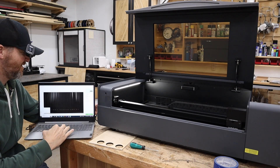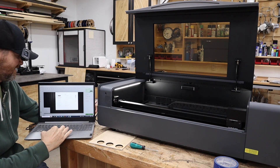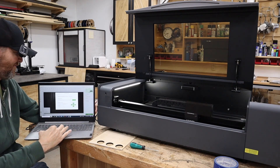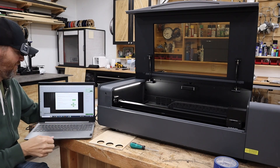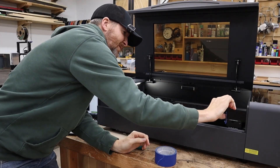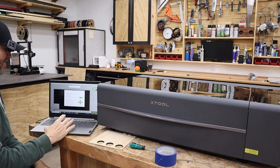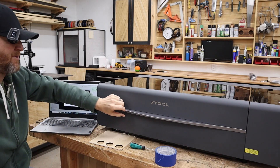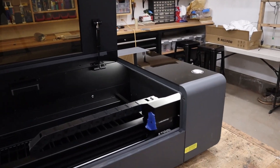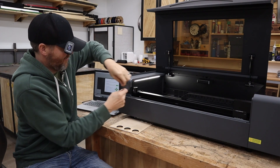To calibrate the laser, we go into the gear icon, down to settings, and do an optical path setup test. You can control the laser module from there. You want to have it in the far right corner, then use a little piece of masking tape to see where that laser is at. Shut the machine and run one pulse — it just shot a quick laser beam across. I'll zoom in for the results. It's calibrated right in the center of that circle. I did have to adjust the mirrors a little bit.